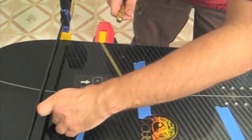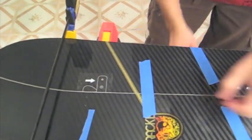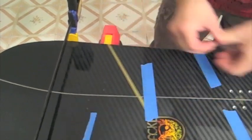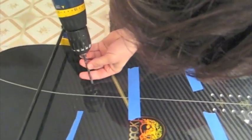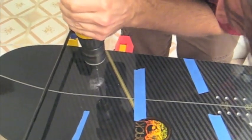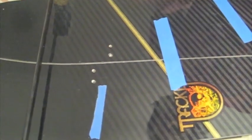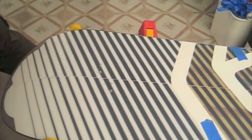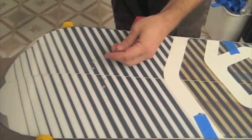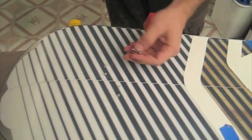I'm going to take off the sticker now that I have my four holes. Then you take a 3/16th drill bit and drill these all the way through the board — make sure you cut them straight down. Now that I have my four holes, I'm going to flip the board over and from the bottom use the countersink bit. You want to make sure you have one of your bolts on hand so it fits right into the hole — you want it to go just below the rim of the board so when you run your hand over it, it barely fits in there.